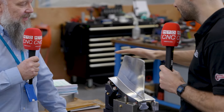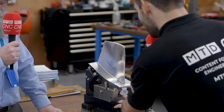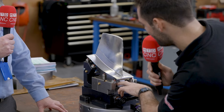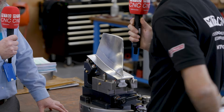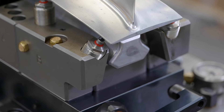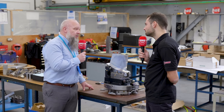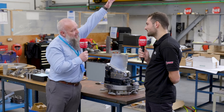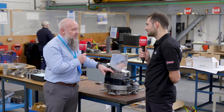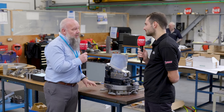They've achieved some beautiful geometry — I pity the person who had to cut this in half on the band saw! Now, you're holding on this kind of dovetail and there's a lot of precision involved in how you clamp this fixture. That dovetail at the bottom of the root is key to the accuracy. If that's not right within microns at this end, then we're going to be millimeters out at the top of the blade.